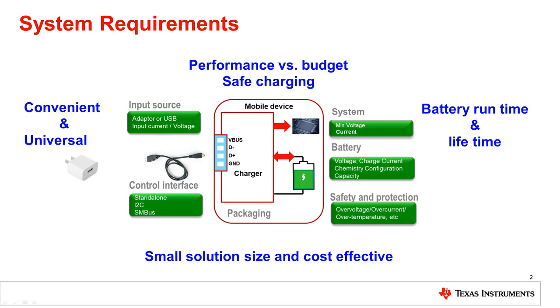Looking in the bottom right corner, we see that safety and protection are important as well, especially when working with batteries. Our charger ICs have quite a few features built in to protect against situations such as a short circuit or an overvoltage condition. Our devices are also highly configurable using I2C or SMBUS protocols to configure set points for these various safety features as well as other advanced capabilities.